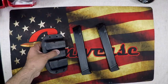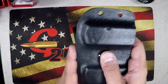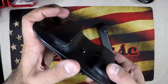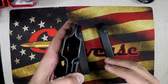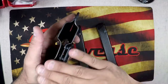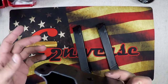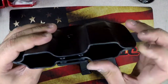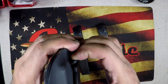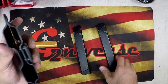We've got this all formed out and sanded. We used wet/dry sandpaper going from 500 to 1000 to 1200 to polish the edges so there are no sharp edges. Then we used the Dremel with a polishing wheel on medium to low speed and ran it around so it's nice and smooth with nothing to get caught on. We lucked out — the belt clip fits right here in the middle, a little tight but it definitely works. We also added the tension screw here to adjust the tension on the magazines.